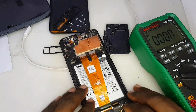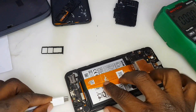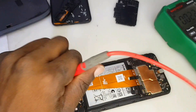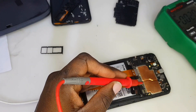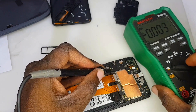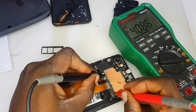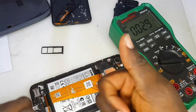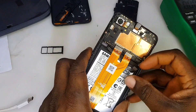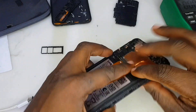I want to read the voltage coming right to the VBAT. Putting the meter on voltage mode — black probe on ground and the red probe on the positive side of the battery terminal — just to read the voltage. And we have four volts, which is very good. So it's either you plug the charger in for longer hours so the battery can boost up, or you can boost the battery manually and then continue charging.